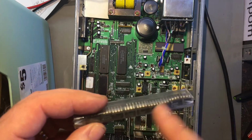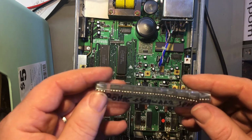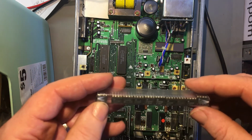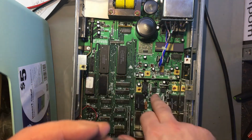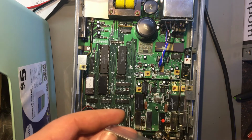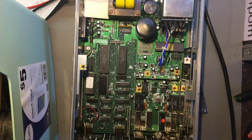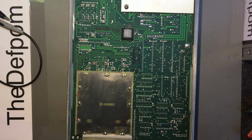But if they are pin for pin identical, at least in some way, I might be able to do that and just drop them in there and just use it as testing. Right now, I'm suspecting that that op amp is failed. That's where my head is right now. It could be something external to that, but I believe that's what the part is that's gone wrong.